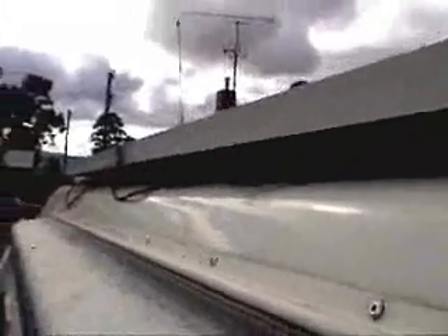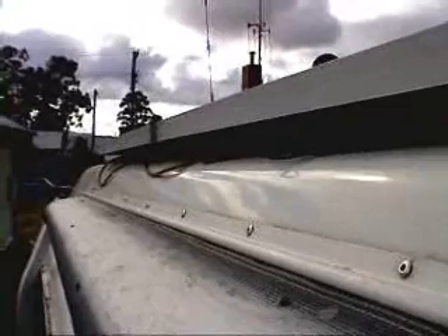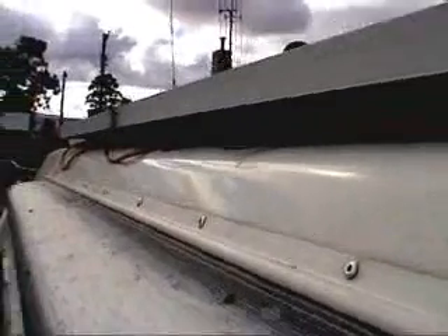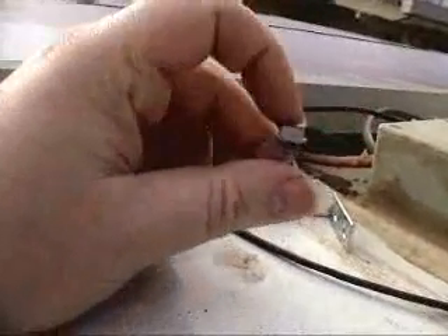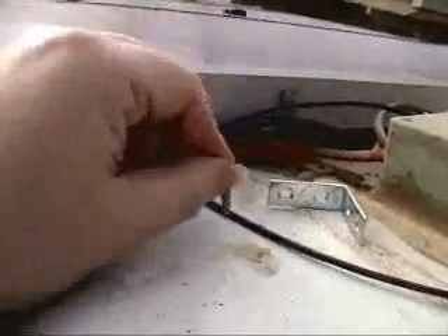If you zoom in underneath them, you'll notice that I've got controller boxes or junction boxes for them. Before actually mounting the panels on the roof, I wired them up because there's not much room to work with under there, so it makes sense to wire them up first and then connect them. To connect them, I've used pop rivets in the side and these little angle brackets — cheap and easy to use. In addition to pop rivets, you can use roofing nails. These particular roofing nails have a little rubber joint and they just screw in. Roofing nails are used because they're designed to go into a metal roof.